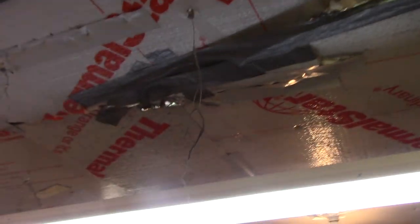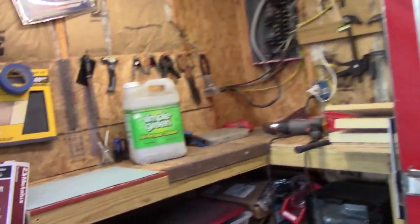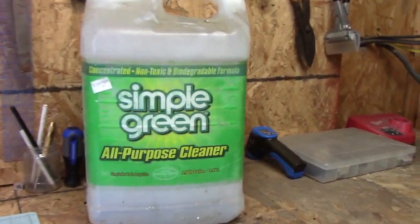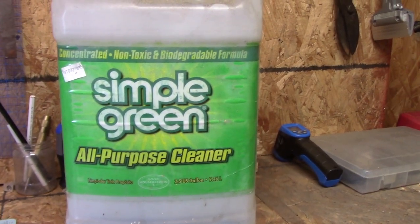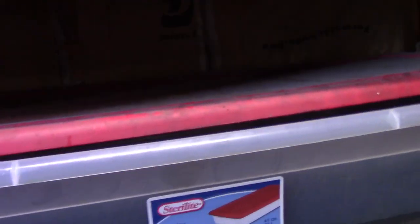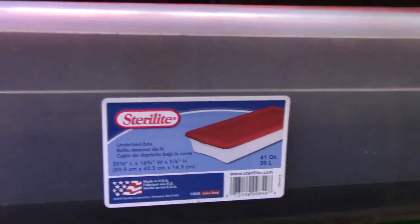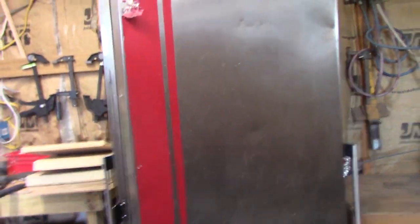To hang parts for painting, I just got some cheap picture-hanging hook things screwed into the ceiling and use that wire to hang a barrel. For degreasing I use Simple Green — I contacted Cerakote about it and they said that's fine. The problem with acetone is it's expensive and you need a metal container for it. With Simple Green I just got one of those under-the-bed tote bins, big enough to soak a barrel in.